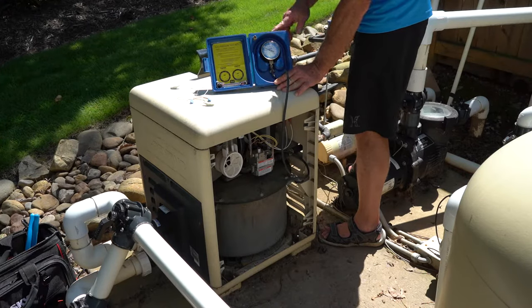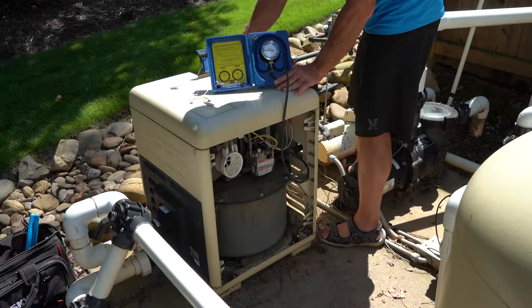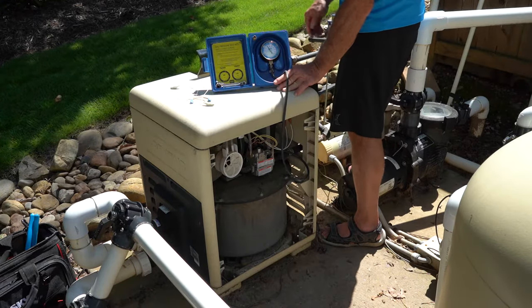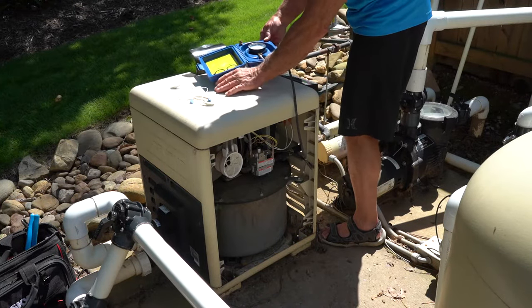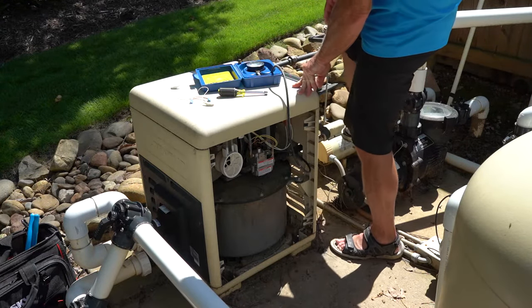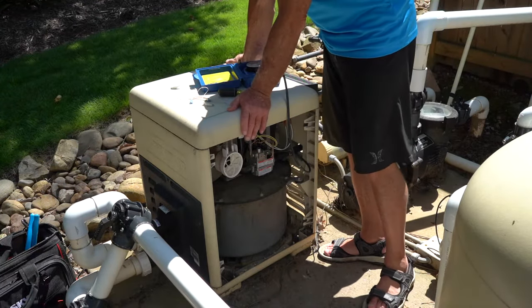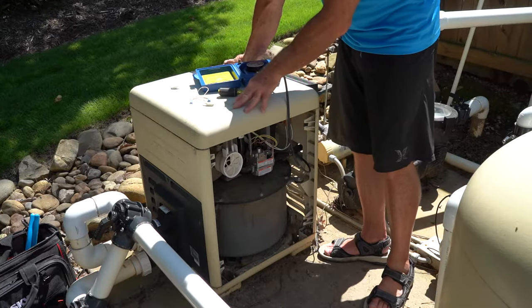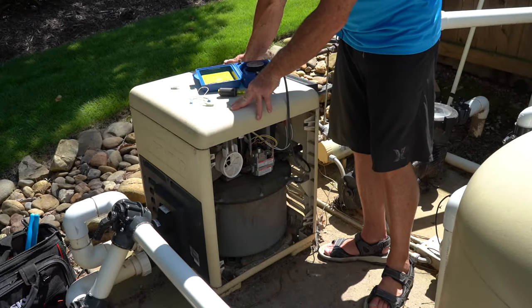If it does drop more than two or three inches of water column, then you probably have an issue where you don't have enough gas volume. We got it fired and we're back off. We've verified that our gas pressure is correct — we don't have an issue there. A lot of people believe it is the ignition control module not receiving the flame information, but that's a lot more rare than this situation.